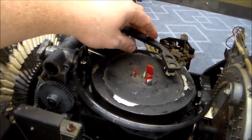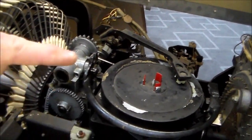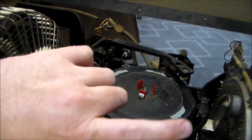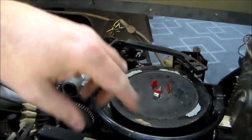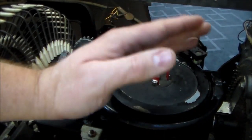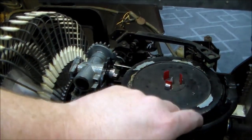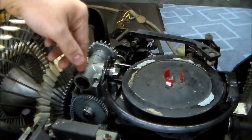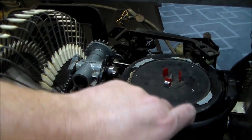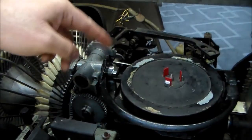I need to get it to where if it's in position it will immediately fall back down, but right now it's slowly going back down because that grease is keeping it there. I'll put it in operate and get it to the end of the record — that's an old needle so don't worry about it. When I put it back in operate you'll see this jumps up a little bit, which is the same issue: it's jumping from the torque. If it were loose and well-oiled it shouldn't do that. I've really got to take this apart and get all the old grease out, oil it, and put it back together.